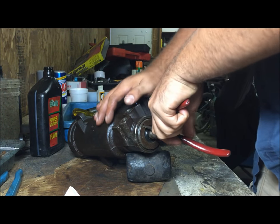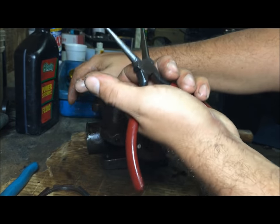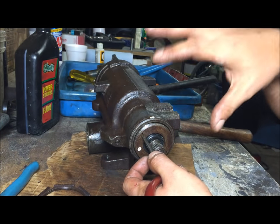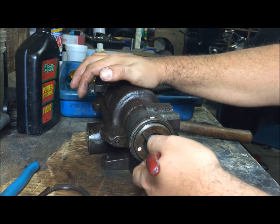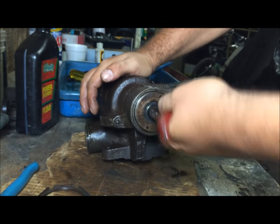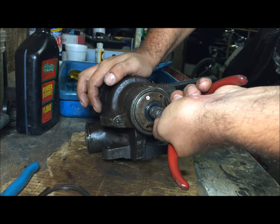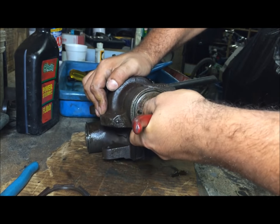When it feels really, really tight, I would recommend using this piece of crap method with needle nose pliers to do this part, because you're not going to over-torque it by accident. So run it in. It has an O-ring. It will get tight, but you want it to bottom out or stop. Whenever you feel it stop,